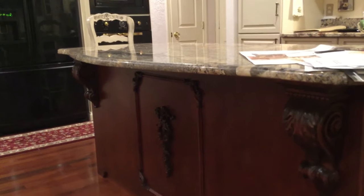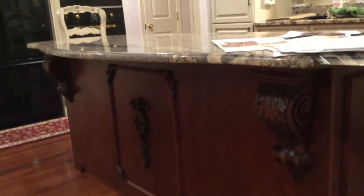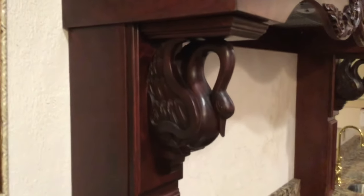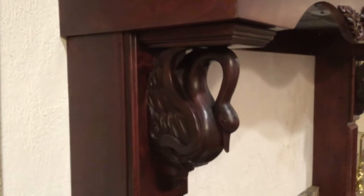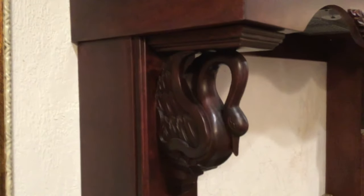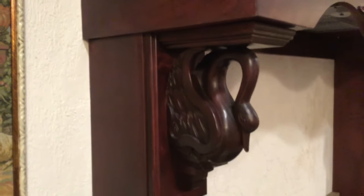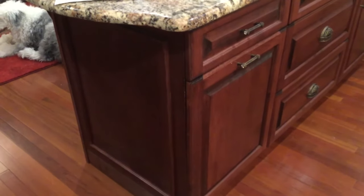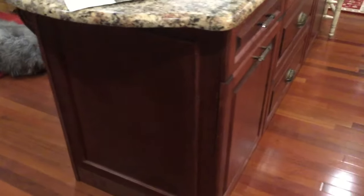You want your woods to be compatible so that the colors are similar. Otherwise — and I'll show you because I could only get it in one wood — you get different colorations. The swan piece was in a softer wood and the wood sucked in the stain, causing it to be very dark. I was careful and tried to mix down the stain a little bit, but it still ended up very dark. So make sure you match the hardness of your woods. My brother built these cabinets out of birch plywood — I'll confirm and put it in the description.